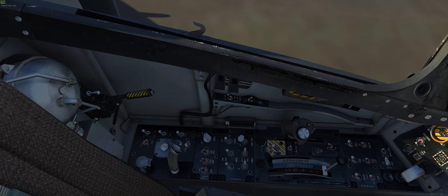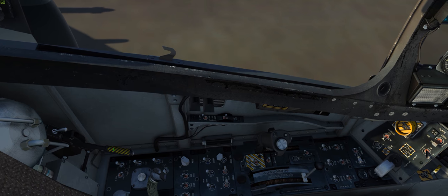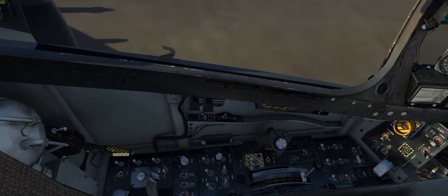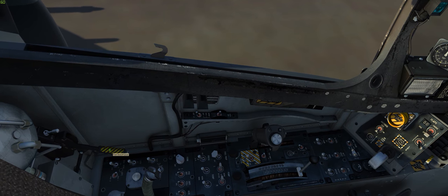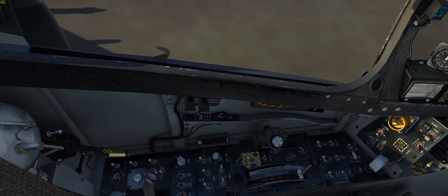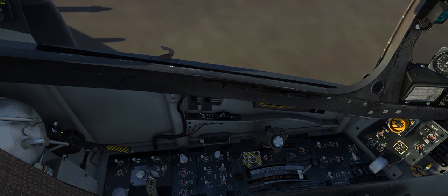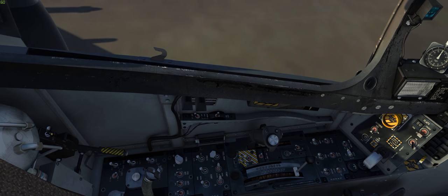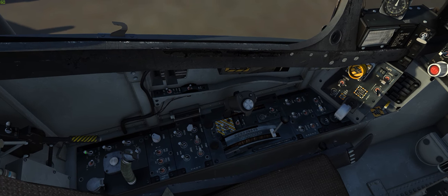Okay, well that's starting. We're going to start setting up our systems now. We're going to switch our fuel cutoff lever here to the on position, which is a bit of a contradiction from what I can see. If it's a shut off lever and it's in the on position, it should be shutting off the fuel. It's not the case. So we're going to switch the deck switch to on, and this is the engine control management system. Nothing here, everything here should be in default.